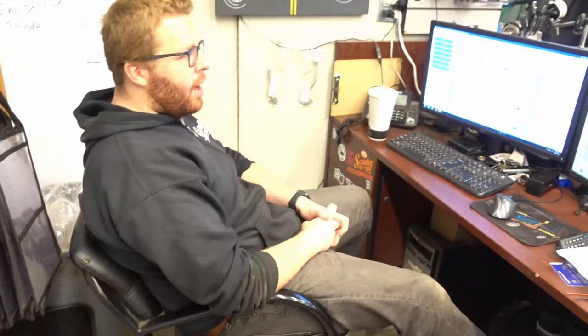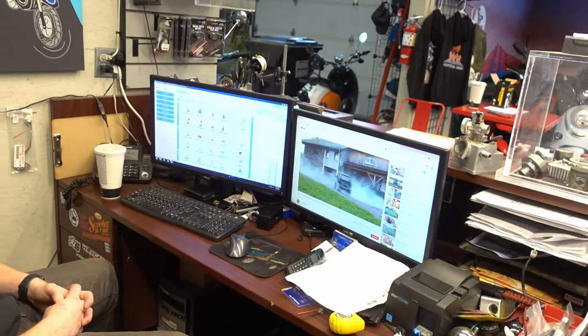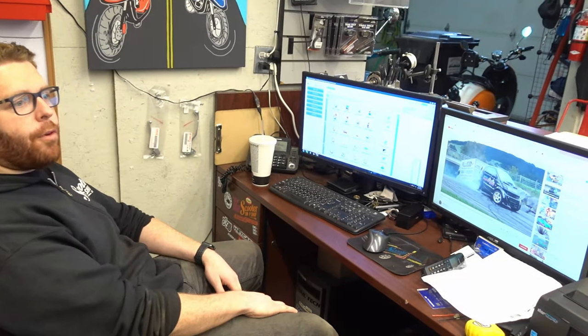Well, I think NA is pretty cool. I think it would be a little bit more drivable NA, maybe, but that looks pretty drivable too. I think the point about the exhaust is definitely a strong one too. If I'm going to spend a thousand bucks on headers, we're going to spend a thousand bucks on headers anyways. If we spent a thousand dollars building a nice exhaust system for NA, that would just basically be money down the drain if we ever did turbo later. Unless we did a rear mount turbo downstream, then we could still theoretically use those nice headers. That'd be the only way, though. So that is something to consider — if the headers are made correctly, we could always use those headers later. You have a lot more lag, though. Way more lag. Yeah, but if it's a foot downstream, it's not going to be super excessive lag.